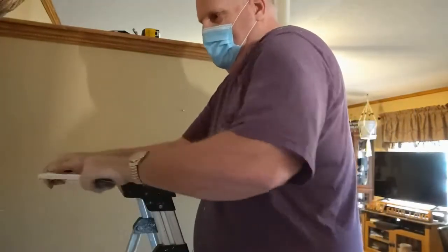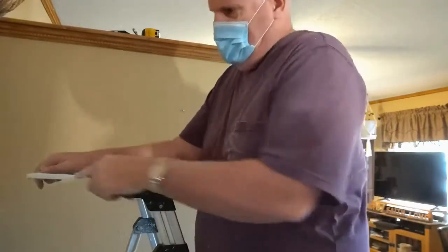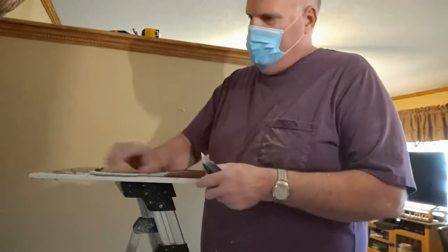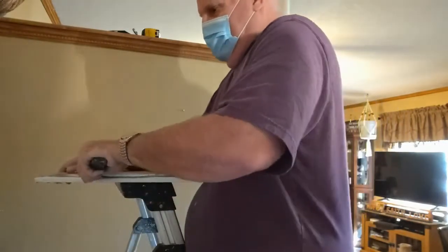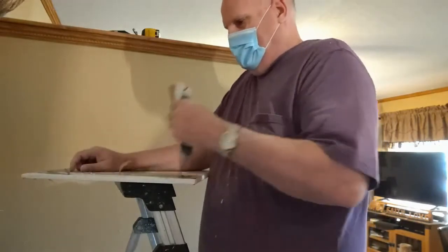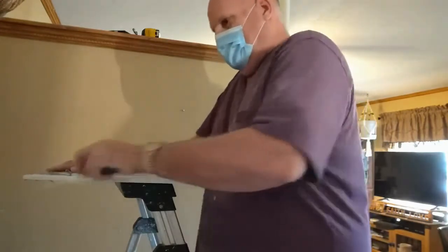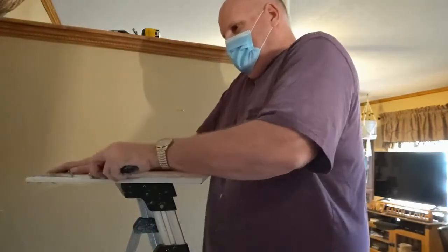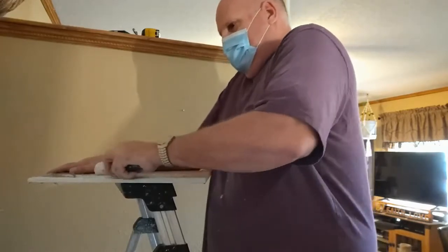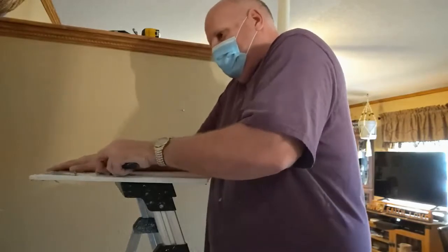A lot of people have asked me, I've been doing this remodel work most of my life. So, like when you put showers on, you do drywall over the top of your shower edges. I tell people to cut a dado and remove some of that drywall, and they don't really understand. So I wanted to make a video so if I ever come up against that, people would have an idea of how to dado.